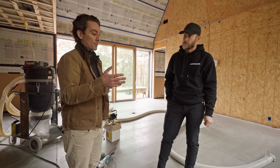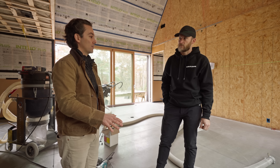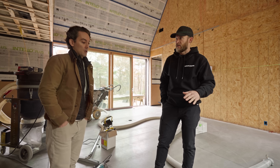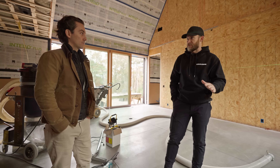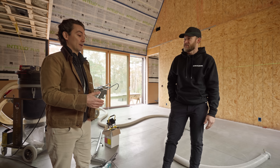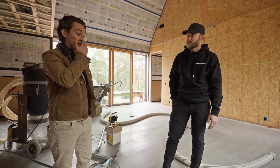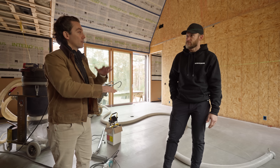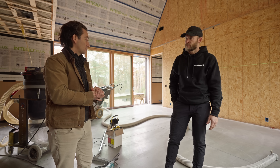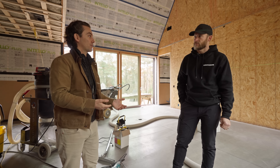I love the idea that you take a commercial, workaday foundation system and just delete everything else — finish it to that same level. There was no special concrete, no special mix. It was just: you're placing a slab. And the one tolerance we specified was just make it flat. Use a laser screed, get it dead level. Because if it's not level when you go to cut and polish, the high and low points are going to register differently, and in some places you'll see more aggregate.